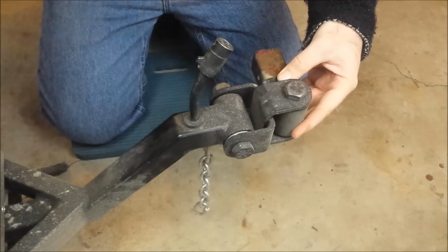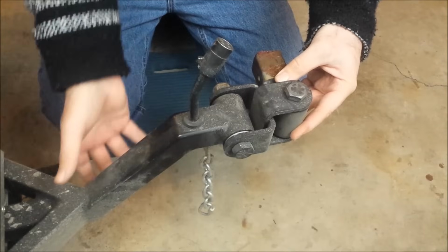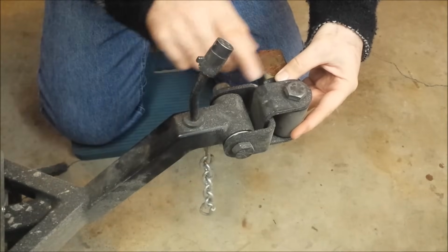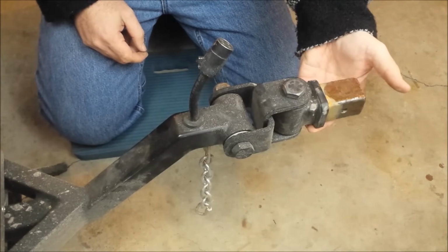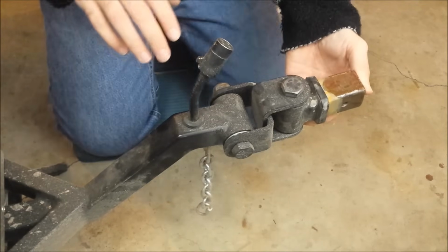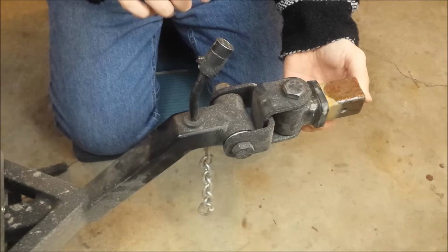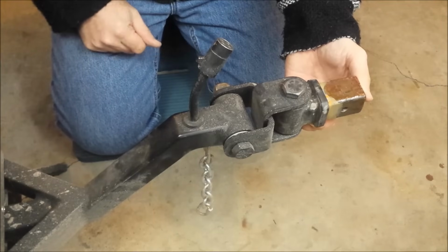If you switch it back in your mind where this is the bike now, and this is the trailer, the way that it's built, this can still pivot up and down. But the trailer also can't fall one way or the other because of it being this way. I know, as simple as that might sound, I didn't quite understand it, because in my plans I had it drawn backwards from this for quite a while. And then one day it just hit me that, wait a minute, that's not going to work. So roll that around in your head if it didn't click.